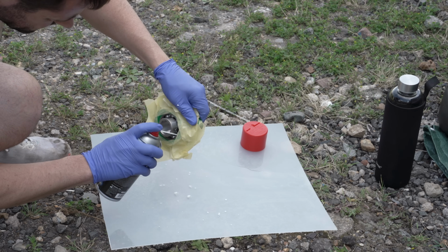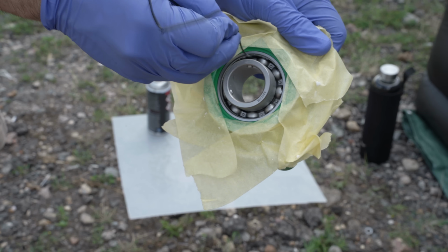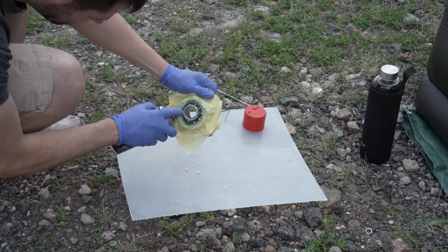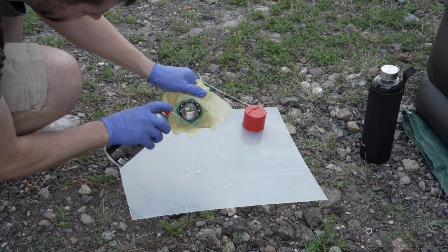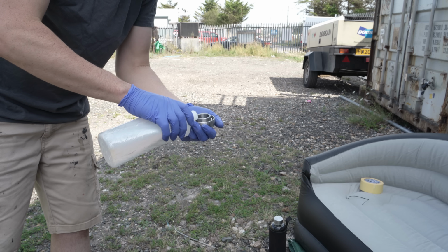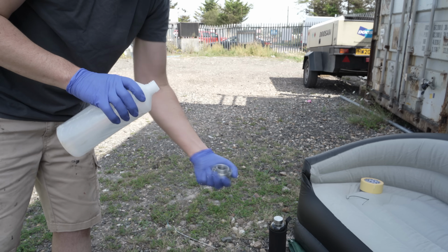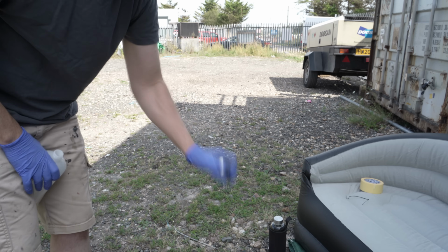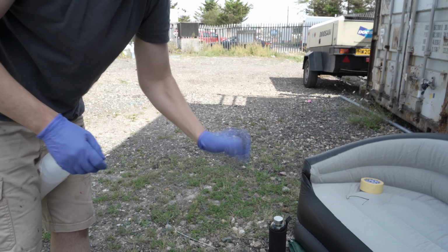There are still some little balls of grease hiding behind the cage, so I got in there with a little clean piece of wire to break up the globs. Another blasting with a pressurized can of cleaner finished off the job. Now, brake cleaner isn't like pure acetone, so you can't trust it to totally disappear in a fit of volatility. So, having double checked that nitrile rubber is compatible with alcohol, I sloshed it quickly with pure isopropyl alcohol to dissolve any residue and shook it out.